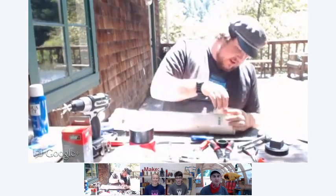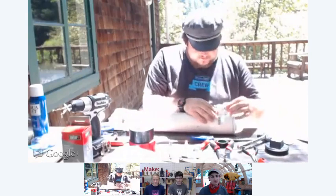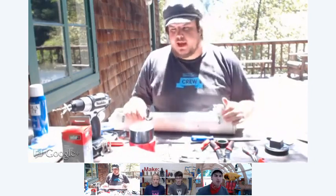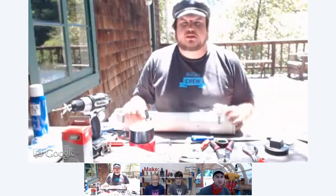So you should be careful when you're building this to wait for the glue to dry before you start playing with it. Okay, and how fast does it dry? Is it pretty quick? Yeah, like I said, for full pressure use, you just need to wait 30 minutes. And it will vary by the different type you're using too, right? So yeah, with small diameter pipe, it's faster. With larger diameter pipe, it takes a little bit longer.